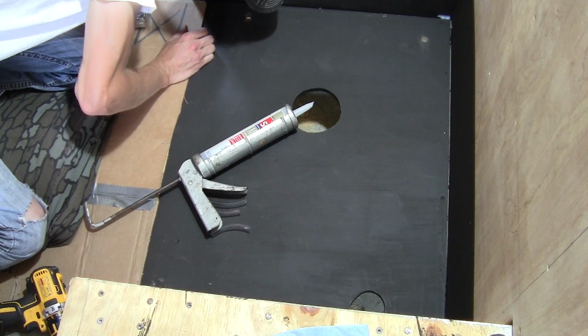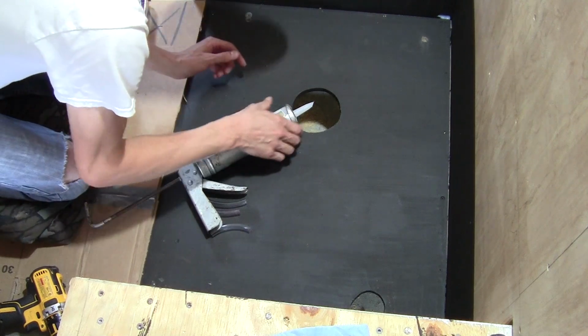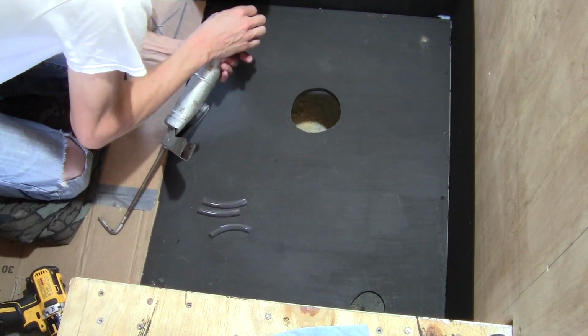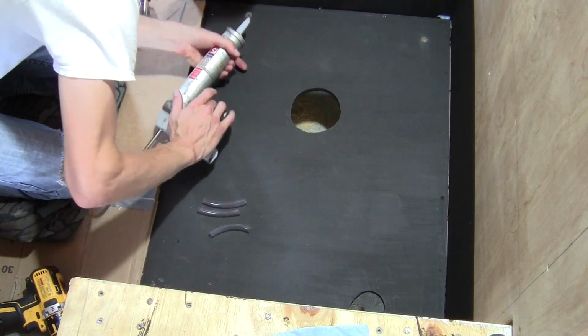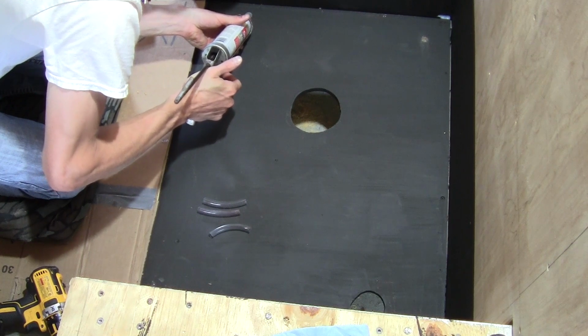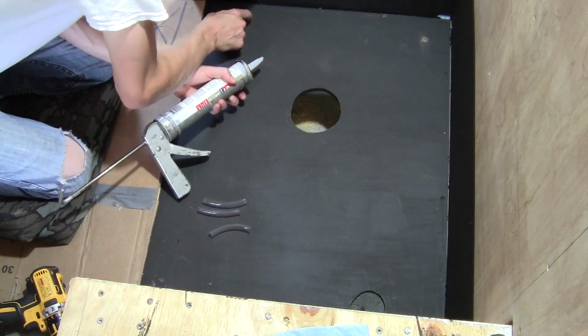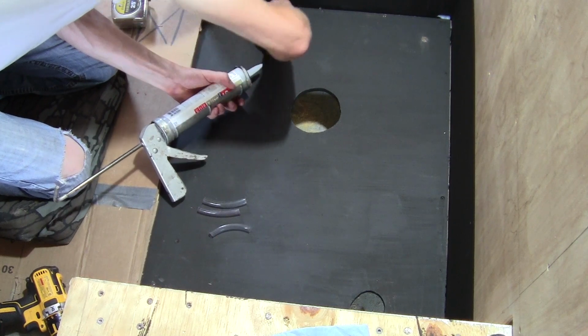And on the underside, in the future, after the aluminum gets put on in the bottom, we'll just zip tie a little screen to it so no bugs or anything crawl up there. But the plan is to never see water come out of any of these 4 tubes ever in the life of the camper. But it's kind of just a little bit of an insurance policy to know if it is leaking at least and have like drainage.